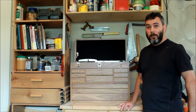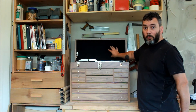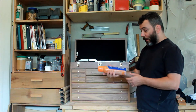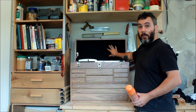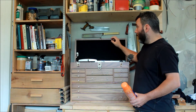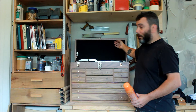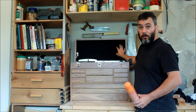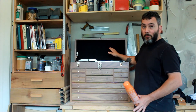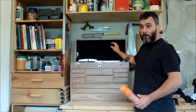Another question I received was what I used to glue the wool onto the tool chest itself. What I used was a spray adhesive — this one is from Elmer's. You spray both the wool and the wood itself. With the lid, I had an issue where after three weeks it started peeling off, so I would highly recommend spraying the whole lid and giving it a second coat, then spraying the wool, letting it dry, and then applying the actual gluing.